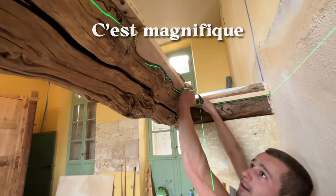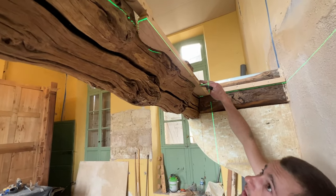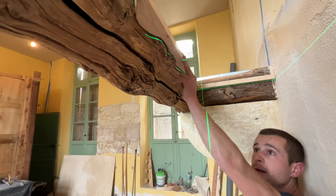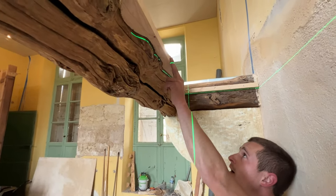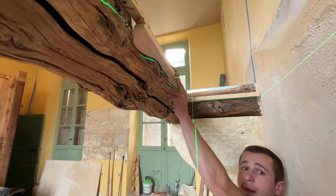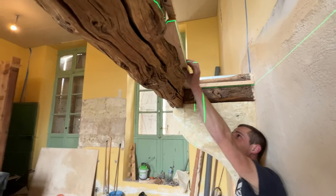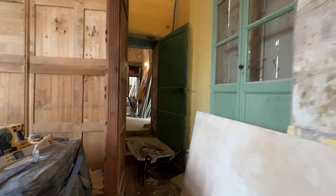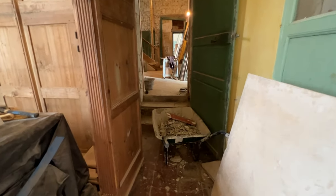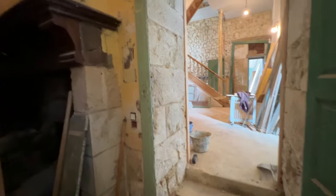And there you go. So he's getting that to fit in above the green line so that this is all nice and sealed up. Because it'll be the ventilation here, but you don't want the gases going up around the fans, the cooking grease and stuff like that. So he's just getting that all nice and fitted, and that creates a frame to mount the ventilation fans inside the hood.